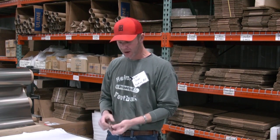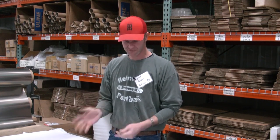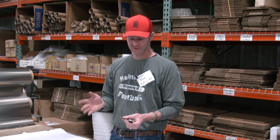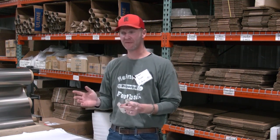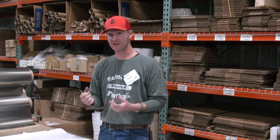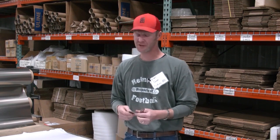So now you're ready to start setting the detent, and this is one of the most crucial things on a frame lock or liner lock. Depending on what style of knife you're doing, be it a flipper or a thumb stud, those are going to be set up totally different. The flippers need to have a very powerful detent. If I set one of my knives up for a flipper and then put a thumb stud on it, most all of you would probably not be able to open it at all with a thumb stud. It'd rip your skin off. It's too much.